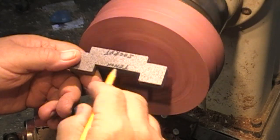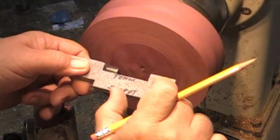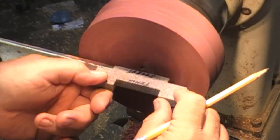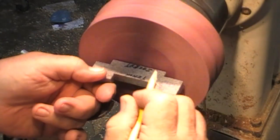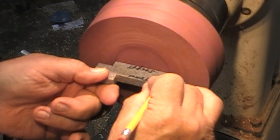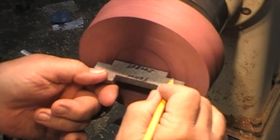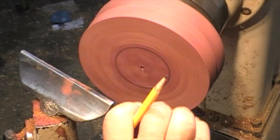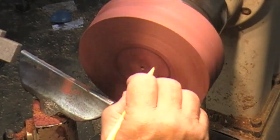This would be the tenon that I'd want to have — that would come off the piece if I want to grab it for the maximum grab. And this would be the socket, or the depression I'd want in a piece, to get the maximum grab on number two jaws. Marking right here — I'm reading it over here. That's going to give me my ultimate opening, the smallest ultimate opening for my number two chucks. So that's going to be my depression.